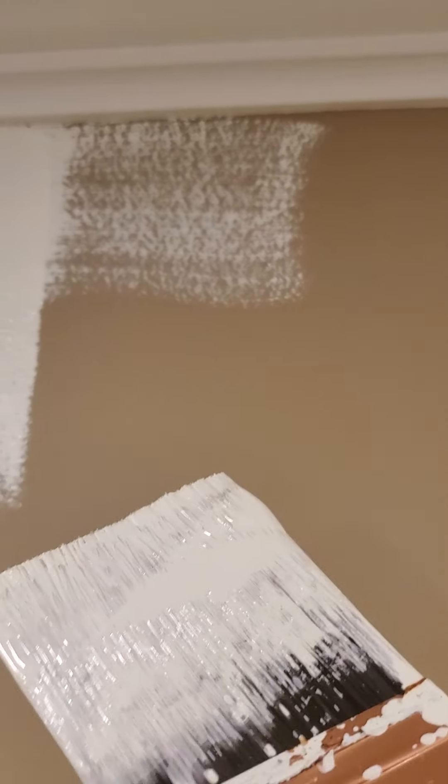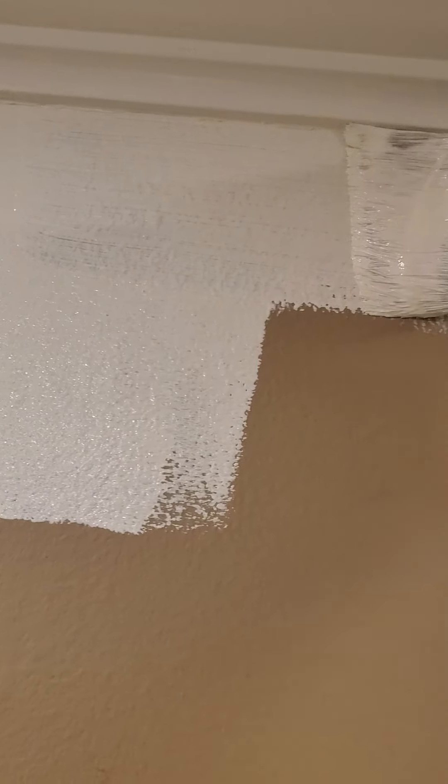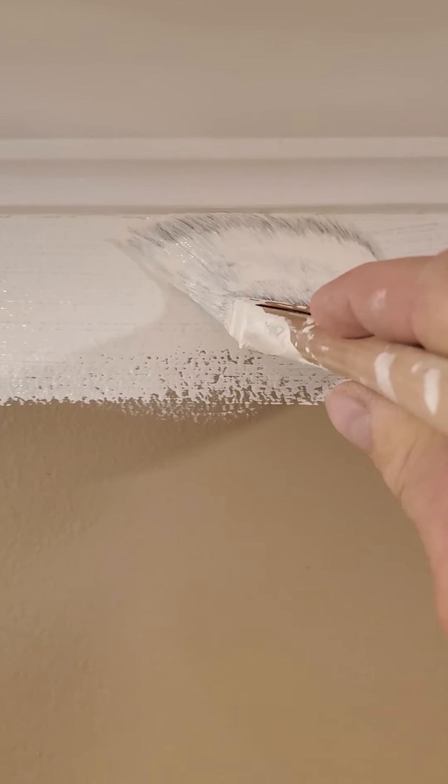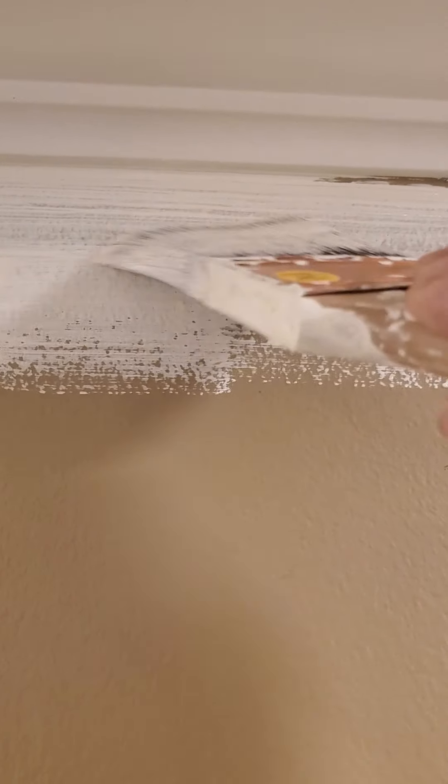Let me get up here on the ladder. You can see I have paint on my brush and I'm ready to go. Because the wall is very close to the same color as the trim, I'm not worried about getting paint on the trim. One method is to pull your brush right near the trim; another method is to push your brush slowly and gently against the trim and just drag it. What that does is give you a thin coat of paint right up against the trim.